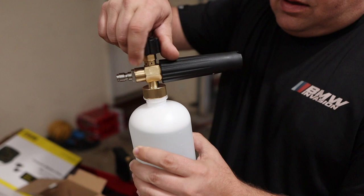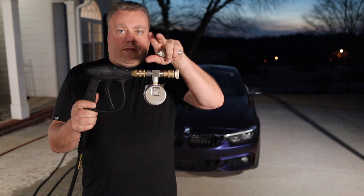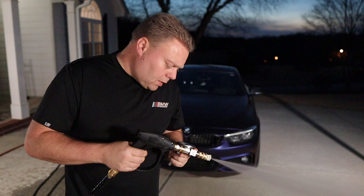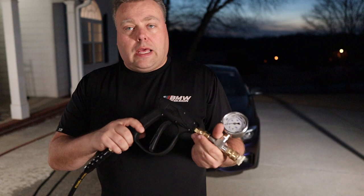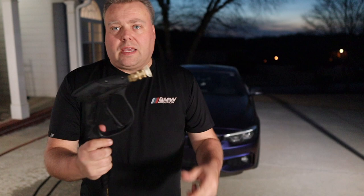Here's our gun. I have a quarter inch pressure gauge on there and my 2.5 nozzle. On this unit, that pushes 1,050 PSI — which is exactly what it did on my other spray gun. It has the exact same pressure as other spray guns. Make sure you're using the nozzle that came with your pressure washer if you're not comfortable knowing what sizes to use.